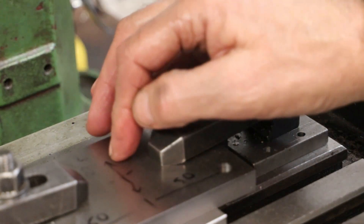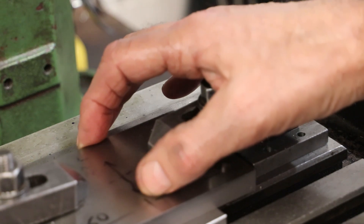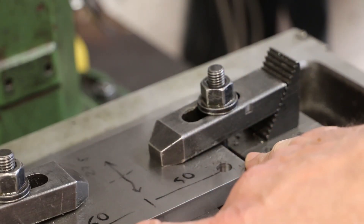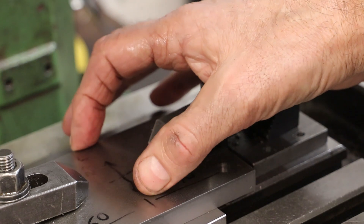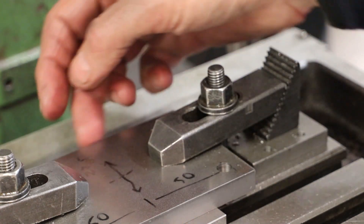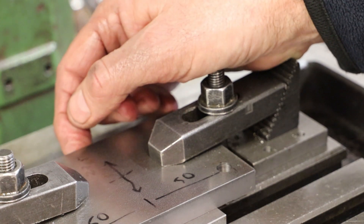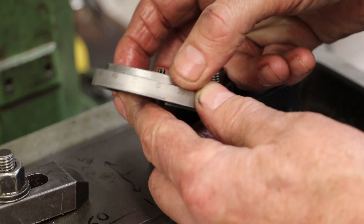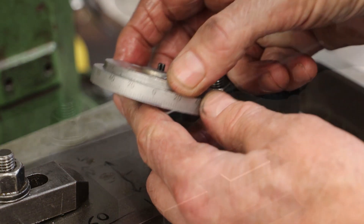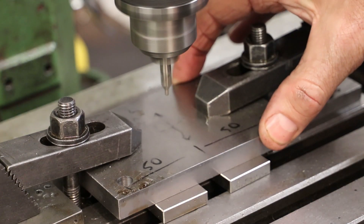Whilst I've got the workpiece in the milling machine, I'll now centre drill the centre of the hole that I need to bore for the plate to go down over the base of the compound slide. The hole will be centred on the X axis but offset slightly on the Y axis such that the hole I bore will actually break through so I can see the scale on the base of the compound slide — the scale for the angular position. The centre drill hole needs to be 6mm offset from the centre on the Y axis.